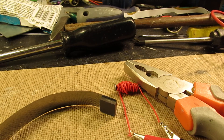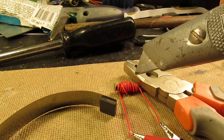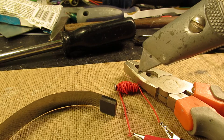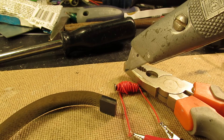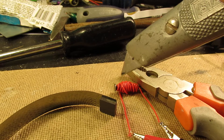In this video, a more detailed explanation about how I made that primitive DC ampere meter. There's a pin here with windings around it. When you want to make it, keep in mind that the isolation of the copper wire inside must be heat resistant, because 8 ampere flows through it, and when 8 ampere flows through this winding, it gets hot.